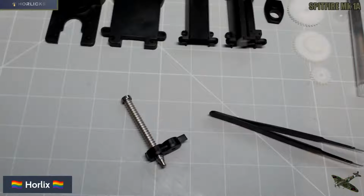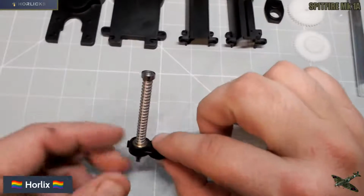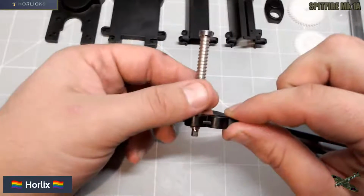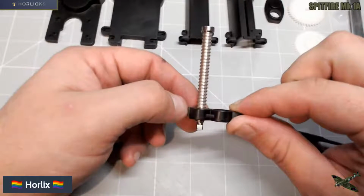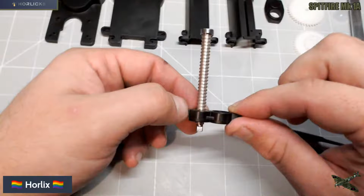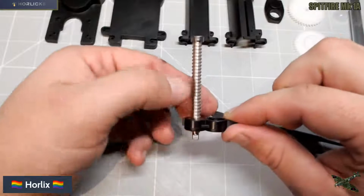So right, step 3 then, which I think you've done actually. As you insert the threaded rod 8112, screw it down into the nut part of 8106 so that the flattened end of the shaft comes through the nut as shown below. So you just have it through there so that the flattened end is through. Okay. Yeah, so that's answered your question about how far to go down.